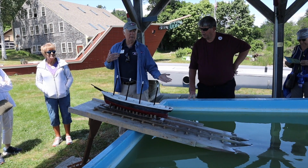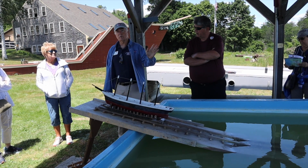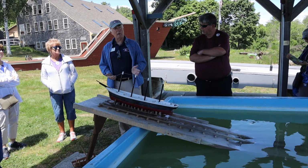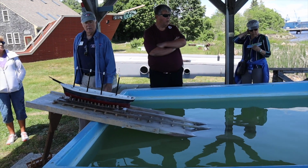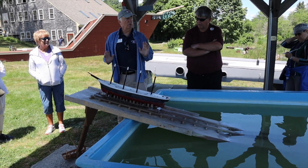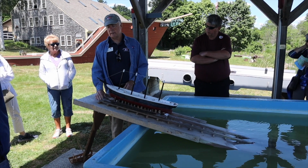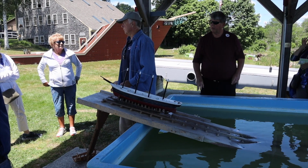Remember, we're in the 1890s, early 1900s, so we're in the age of steam. They would hire a tugboat to come downriver, and that tugboat would be positioned opposite the ways. What it would do is guide the vessel back to the pier after it was launched. Plus, they didn't want it to hit the bank. If a tugboat was not available, they would still launch because they had to hit this 1 hour window. When the boat got mid-channel, they'd drop the ground tackle, the anchors, and wait for a tugboat to become available.